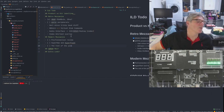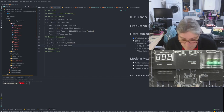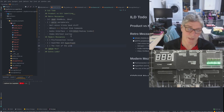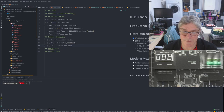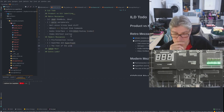Yeah, so what it's sending, Laurie, then, is ASCII, right? And then something on the HDL side will build a menu that it overlays over whatever the current video is being output. I mean, overlaying shouldn't be that difficult in that many of the retro games aren't using all of the colours that may be available. So you could have an alpha channel if you like.